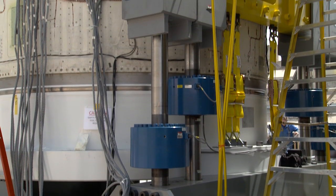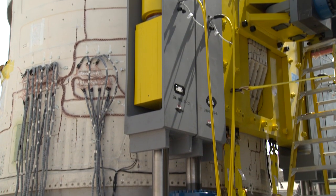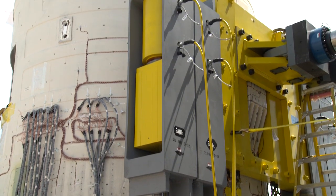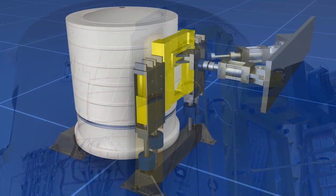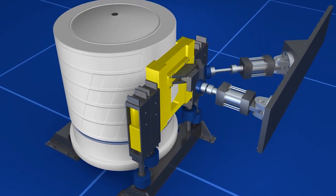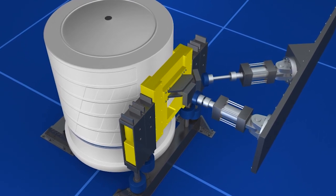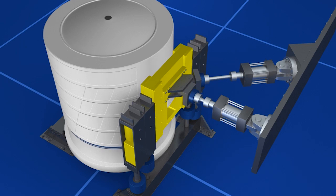We're using one of the old static motor test stands. We've got a force frame that weighs 28,000 pounds — we hang it on the skirt. We attach four 1-million-pound load rams, and each load ram applies up to 1 million pounds of force, measured through load cells that we'll use to determine the capability of the skirt. We're going to start the first phase as a checkout, bringing loads up to around a million pounds of axial load to make sure everything's working.